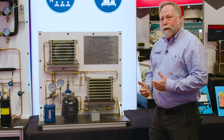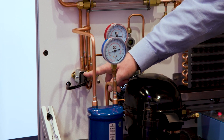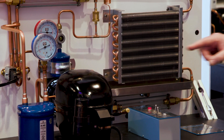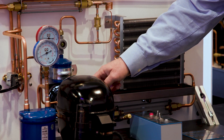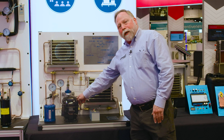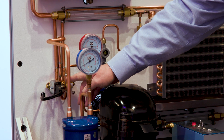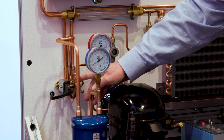As far as some training lessons I like to do with these: they can actually come in and check the voltages right here on the solenoid itself — there's no problem with that. You can also check all the line temperatures as they change. What I like too is that they can go through the system and actually show the refrigerant cycle and explain it out loud. We've got the high pressure superheated gas coming right out of the compressor back here. As we go through the system, you can show how the single line going into the reversing valve is always hot gas discharge.